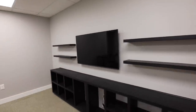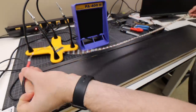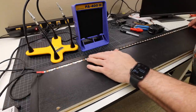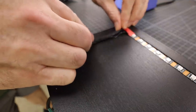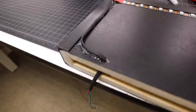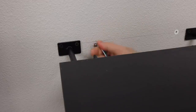The shelves just literally slide over the pegs and are held in place by friction — and man, does that ever look cool. We're going to trick this whole set out with some WS2813 LED lighting; this is the Geek Pub after all. At the front of each floating shelf and each box in the credenza, I installed a strip of RGB LED lights. I used black heat shrink tubing to help blend it in and hide the wires, hot gluing them to the shelf. The wires are fed down the wall using a pull string I installed off camera, making for a super clean look.